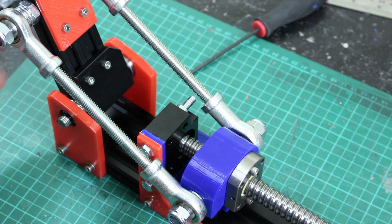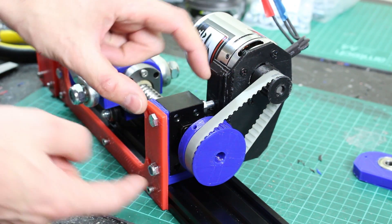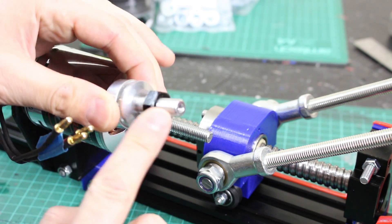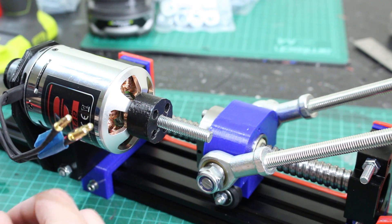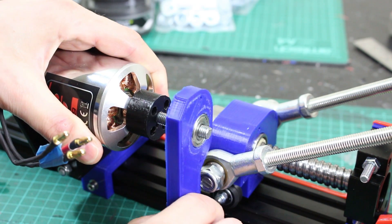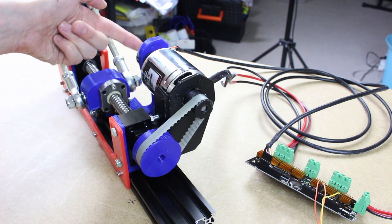For now I'm just going to leave it and pump the numbers into the code — everything should be fine. I've mounted the motor, which has a belt going onto the ball screw, mounted on a 3D printed bracket attached to studding and bolts that go through all of this, making it quite rigid. I need to put an encoder on the back of the motor — the motors come with these which bolt on. However this is an M10 thread and the encoder maximum size it will fit is M8, so I've made a 3D printed one with 8mm studding. I've made a piece with a bearing in that slots on there — a normal skate-sized bearing — that screws onto the 2060, holds the back of the motor square, and gives me a mounting point for the encoder.